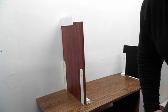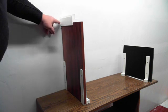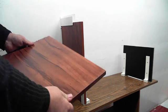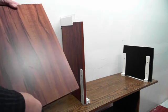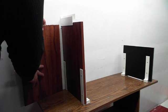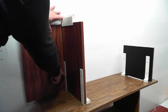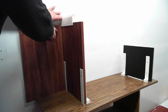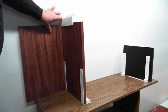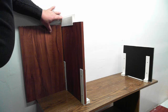This is going to be an upright for a project that I'm going to build for you in a few minutes. The way joist hangers are made, there's a back wall. Take another piece of the shelving that you're going to be using. If you had it cut at a box store, their saws are very accurate, and these are 90-degree cuts. Lay it on the floor right up against the project. Line up the lower joist hanger and the upper one that's attached to the top, so that they line up and they're true. Then you take a pencil, mark the holes on the wall, and that's your first piece.